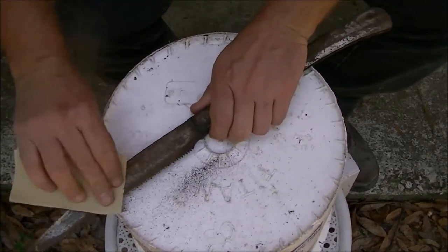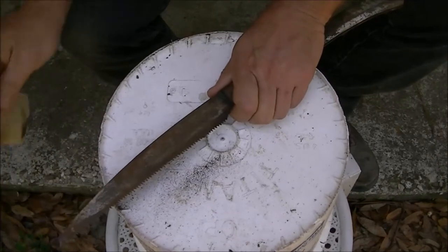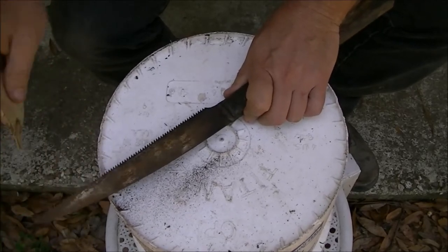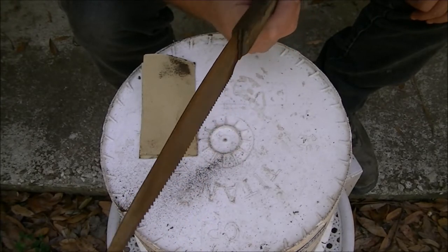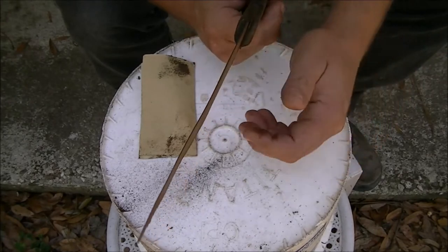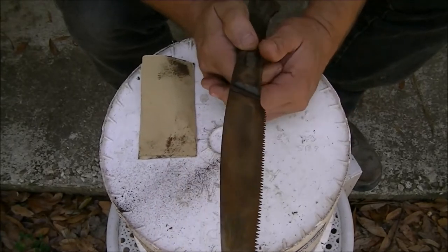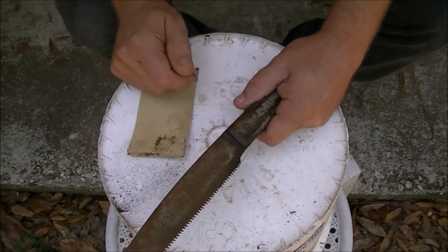I'd like to at least sandblast a blade or something, but I do not have any sand or anything like that for my sandblaster. Sometimes, depending on what it is, you can use ground up walnut shells, you can use glass beads, you can use, of course, sand, different grades of sand, depending on how coarse your sand is. I've also used, for carburetors when I've wanted to really restore an old engine, baking soda. Yeah, just regular baking soda on carburetors. Really cleans them up nice.